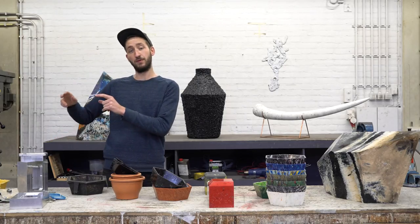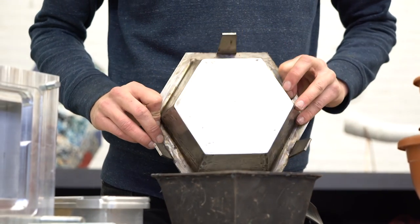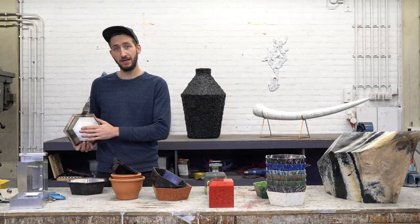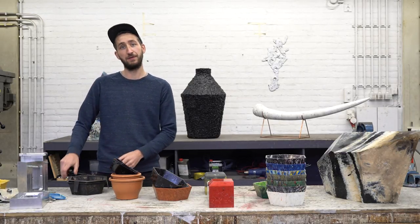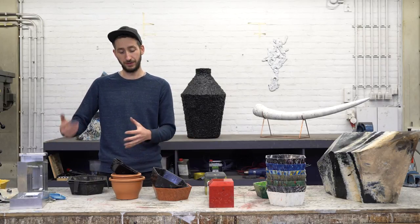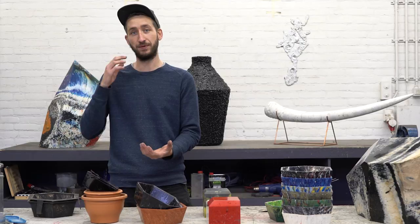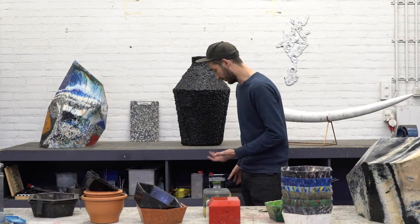However, molds like that are often very expensive and difficult to make. So if you weld your own mold, like this bowl, you need to make sure that the more you polish it and the cleaner you make it, the cleaner the output is going to be. It always pays off to put some extra effort into your mold, because every product you make with it comes out better — which means less work in the end to finish it up. Having super clean and polished molds also helps to prevent plastic from sticking to it, because the smoother it is the less surface there is to stick.